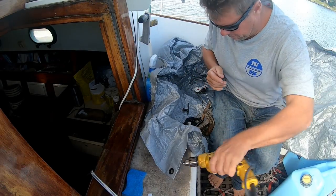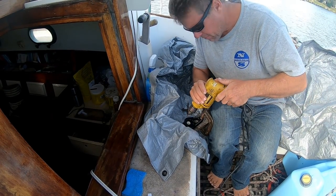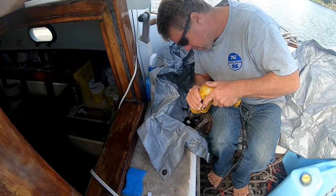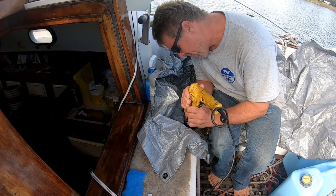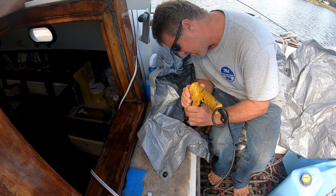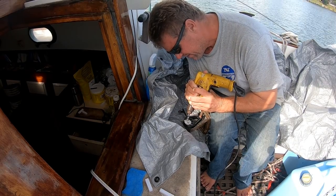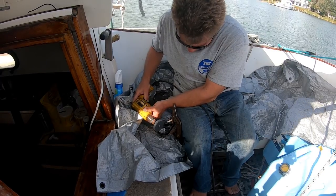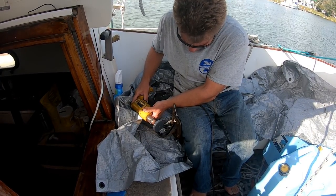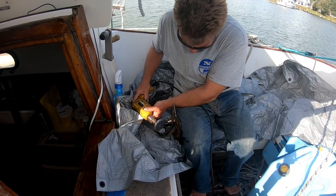Well, the gale has cleared and now it's time to tackle the last of the major projects I want to get done before heading south for the winter - and that is to replace the four lower shrouds, which really provide most of the support to the mast. The rigging presently on there is standard 1x19 wire and there's no sign of broken strands or wear, however they are over 30 years old, so I would feel better replacing them.